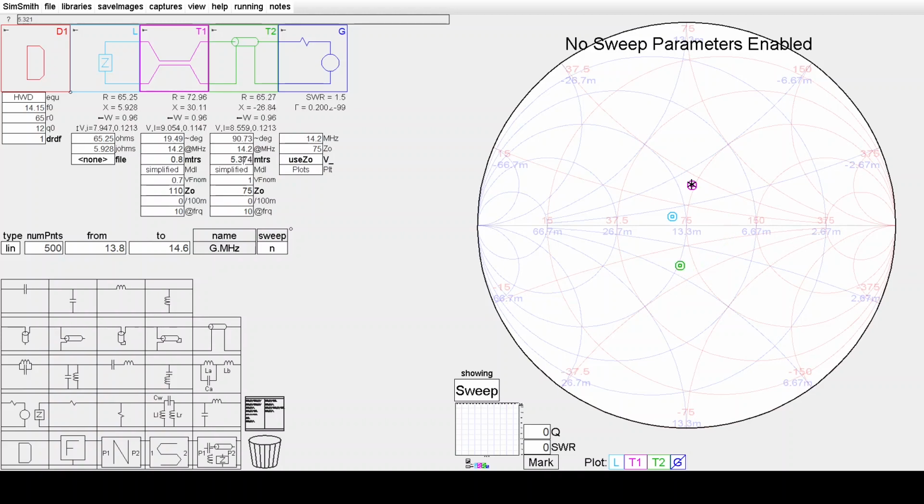And eventually we find that it comes back here across the real axis at 7.689 metres, and the impedance looking into it is 50 ohms with almost no reactance. If you fine-tune that, you can make it 0. So there it is there. We now reach 50 ohms.